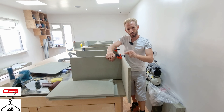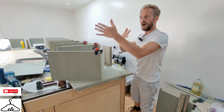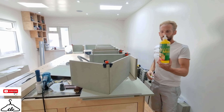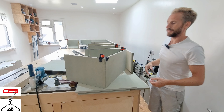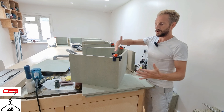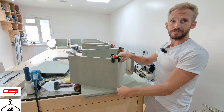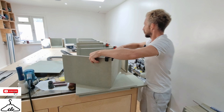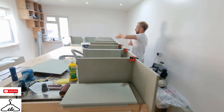So the method is: we do one corner first to hold itself together. There'll be a nice decent glue bead in there. We just use a nice quality PVA - it doesn't really matter which one, we just don't use a cheap no-name brand. Once it comes together we know it's square, and then three pins, 50 mils. Remember to wear your goggles when you're doing this. And then Sean simply does that on every corner - boom, boom, boom, boom, all along.